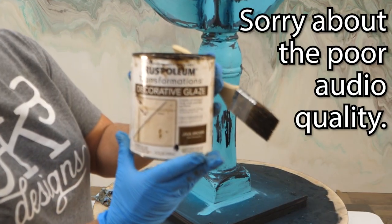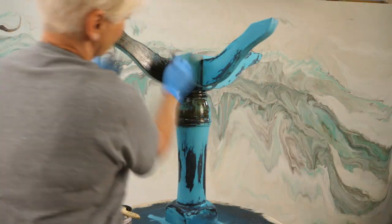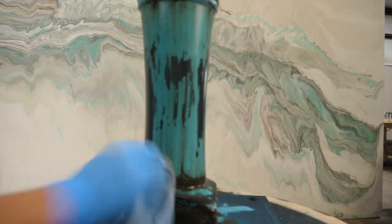I can rub a little and you're seeing a little bit of that darker turquoise — that's all I wanted, just a peekaboo of that color coming through here and there. I really like the middle — it gives it that chippy, layered look I'm going for. I'll continue taking this off, let it dry really well, and then we'll do a glaze. I'm coming in with just an antiquing decorative glaze — this one is Rust-Oleum. You can make glazes out of just about anything. I'm using an old chip brush and some shop towels.